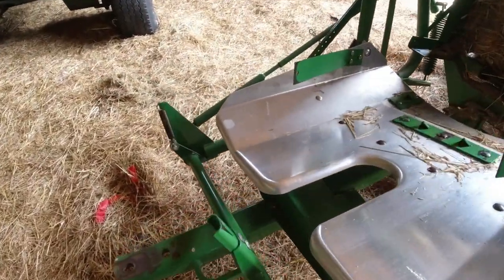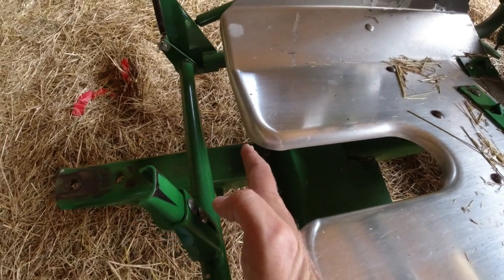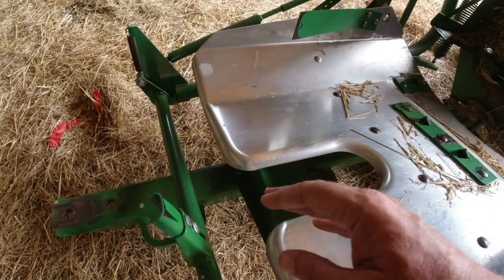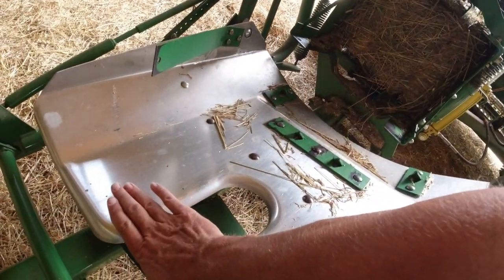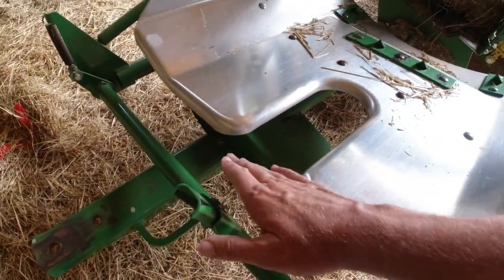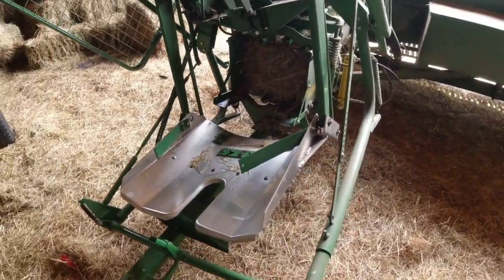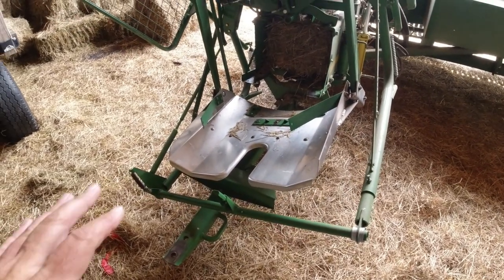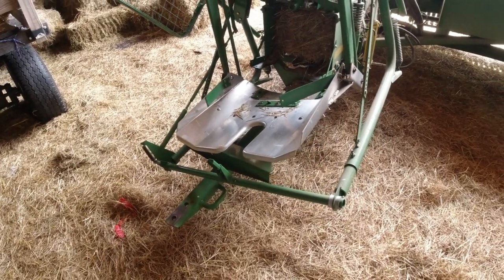And what that did is it moved this trigger mechanism, which was right here, that little bit right there, far enough out that the bales get far enough off of the angles that they fall down like that, and they continue to be pushed by the other bale, and then they push that trigger. That trigger mechanism launches the bale. So I've got other videos coming up of where I've baled, and I haven't had any, knock on wood, issues with this thing jamming when I've been baling and really pushing the baler.